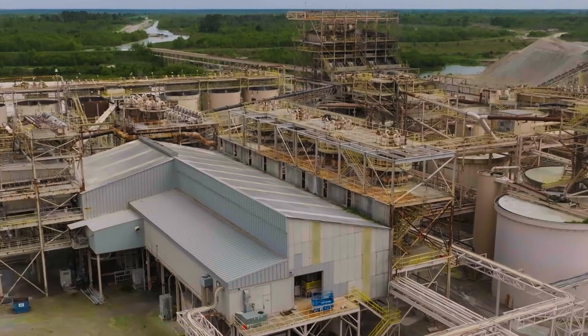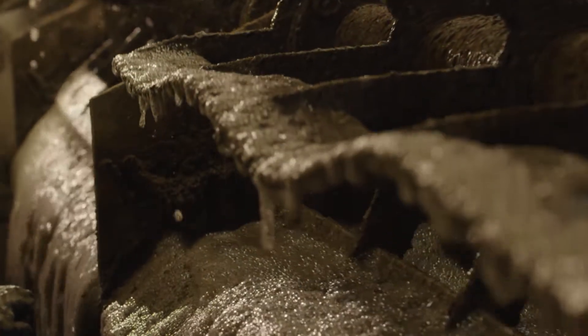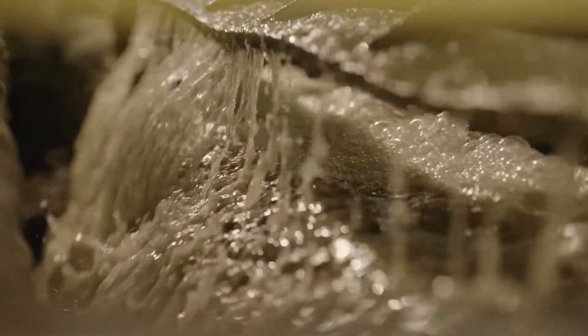The right-sized material will end up getting fed to the float plant. The way it works is we first condition the feed coming in with a pH adjuster, and it actually binds to the phosphate and allows the phosphate to become less dense, so it actually floats to the top with a foam. The paddles are scraping the foam that has phosphate rock in it.